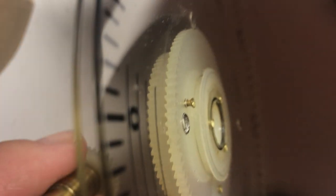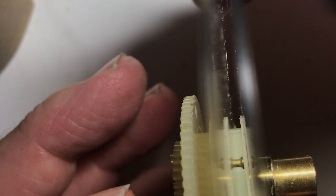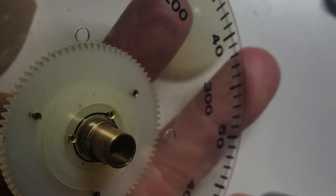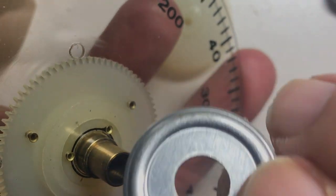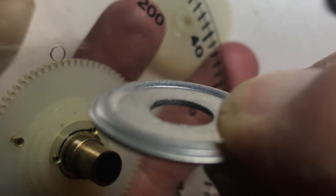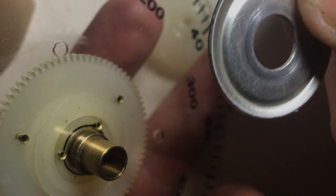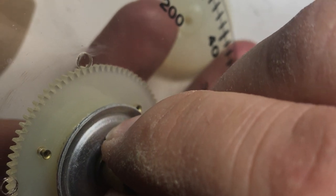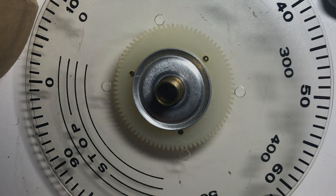Now check your work — how does it look? Looks fine. The pins are in. Let's now put this gear back in here. It seems like I'm forgetting something — I guess not. So we're back together. This ring goes on again as we said in the last video. You want to make sure the side with the indention is down so it covers the pins. You don't want it like that — you want it like this. That's in. Now hold it by the ring gear and put it down. Let's get the circlip on here, which we know is always a terrifying experience because the circlip can fly.